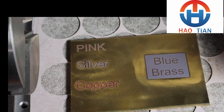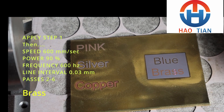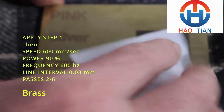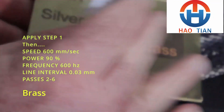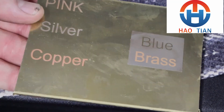Laser colors look spectacular off the engraver — totally spectacular. I don't actually know that they'll stay that way over time. What I do know is that I laid down my first colors about two months ago, and those original test pieces have been handled continuously. Using the following protective methods, so far so good — they've all faded to a stable point. After engraving I use a clear-coating product like a lacquer that I paint on my tools; this gives a protective coating from oxygen and stops the brass from tarnishing and oxidizing. The product I use can easily be wiped off with acetone and reapplied if the surface gets grubby or damaged. I recommend contacting a specialty metal protection company in your area to find a similar product.